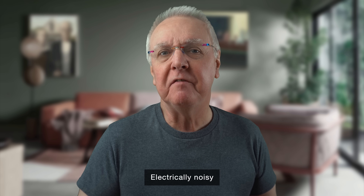Reality number one: optical cables use light rather than electricity. This means that they are insensitive to electrical or magnetic interference, which can be a massive issue. If you use copper and you don't suffer from interference, that's fine — no need to worry. But if interference ever comes your way, you'll prefer to be without it. Worst case: electric guitars close to fluorescent lights, noisy lighting dimmers in a location recording environment, nearby radar installations. Perhaps someone should invent an electric guitar with an optical output — optical pickups are a thing, so why not? Optical cables are also notable for not radiating any interference either.